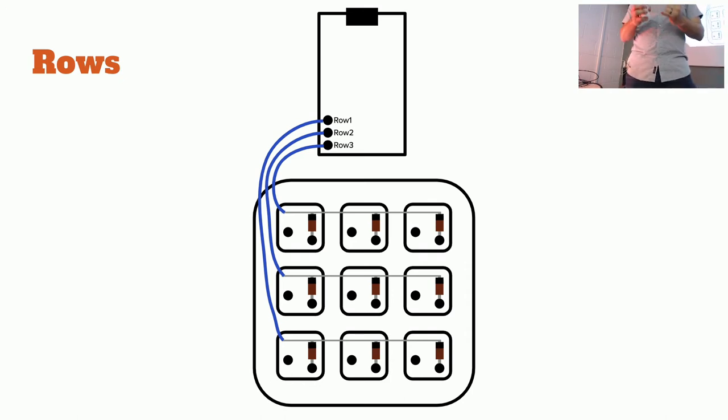You might need some wire strippers, or you can use wire cutters, just lightly cut into the insulation and then pull. I have a set of V-notch cutters if you'd like to borrow those. They make quick work of this. We also have another set of wire strippers up here if you're more comfortable with those.